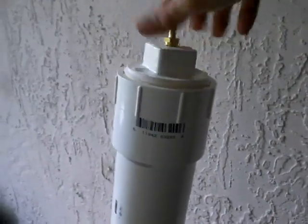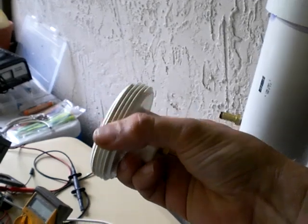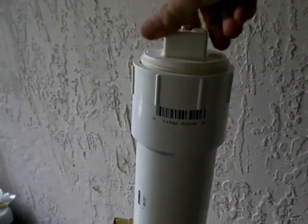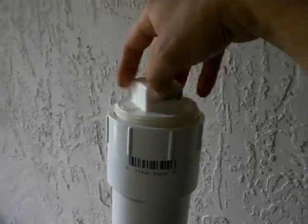One quick tip while I'm here: if you find that your little screws aren't going in very well, take a wire wheel on a grinder and just gently go around on the grooves. You'll knock out the mold marks and the thing will just screw right in there like it was meant to go, not like the way they are when they come from the factory.